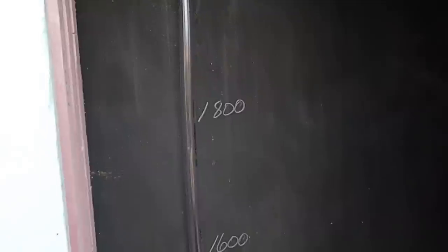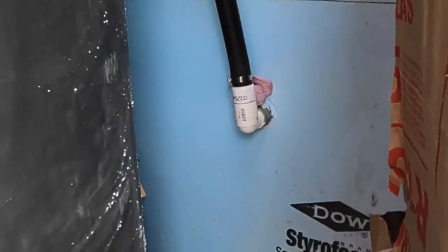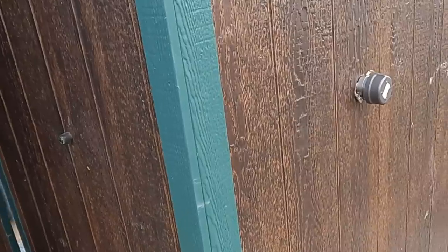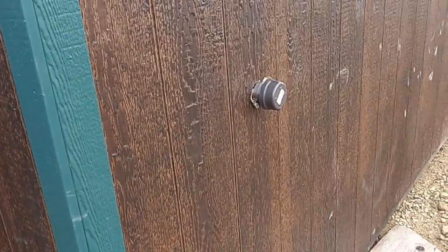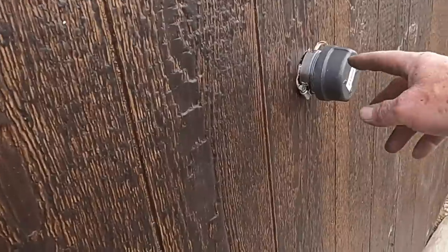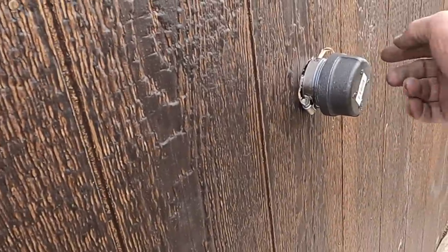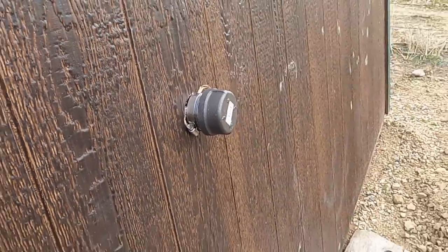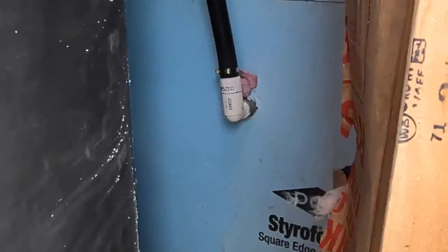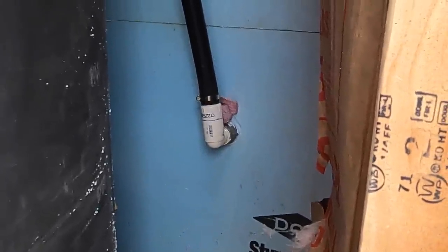This goes up to the top, and going out the side, this is going to be the west wall, 1.5 inch flexible PVC, and I ran it up to the top, and it's connected to a 2-inch pipe that goes clear through the wall, and I've got this cap here. This is where I'll actually hook my supply line. I have a gas-powered pump that I'm going to fill this with. Then that plumbs through the wall there. I've taken adhesive and I sealed all that shut.